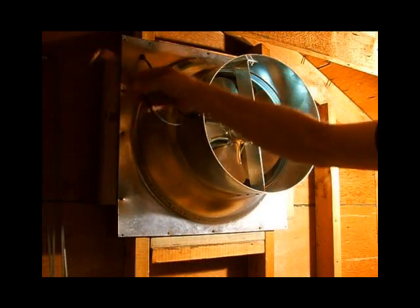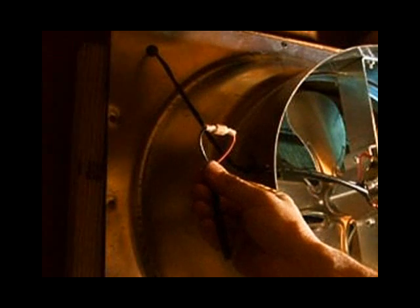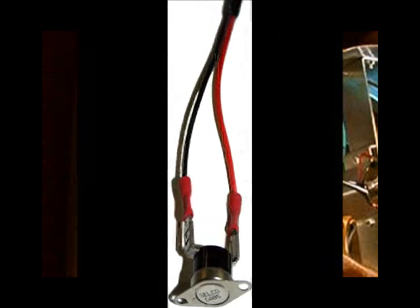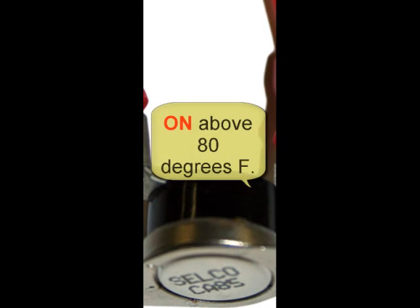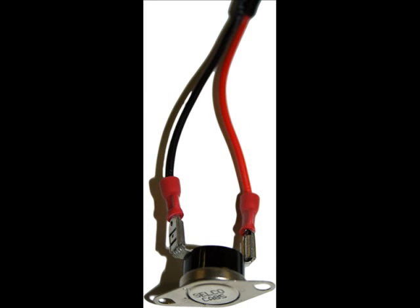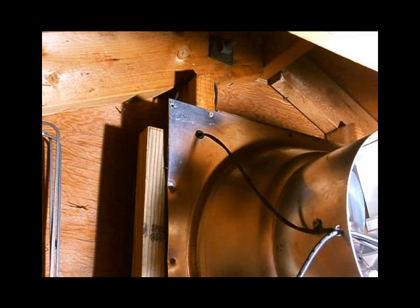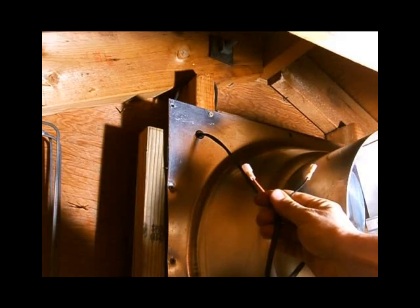There's another cable pre-installed on the fan housing. This cable has a spade clip connection that can be interrupted for installation of the optional thermal switch. The thermal switch can be used as a fan control — it's essentially a preset thermostat, turning the fan on above about 80 degrees Fahrenheit and off below about 70 degrees. Some homeowners I've spoken with chose not to buy the switch, preferring year-round attic ventilation, which they said would prevent wintertime moisture problems like mold growth. I recommend breaking the circuit at this clip while you connect the PV module on the roof — it's like a handy off switch.